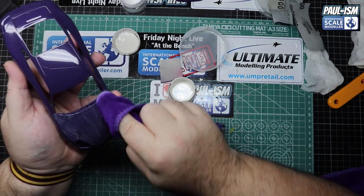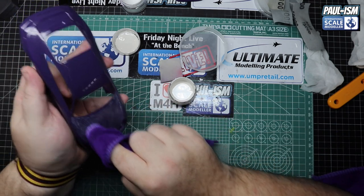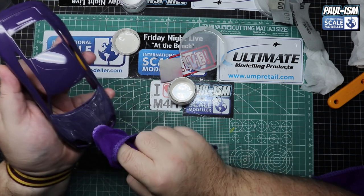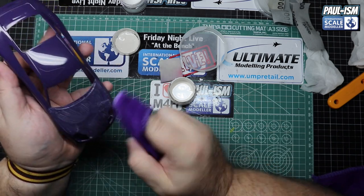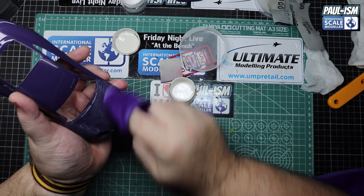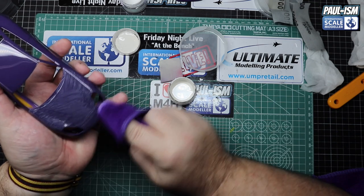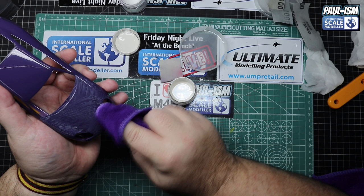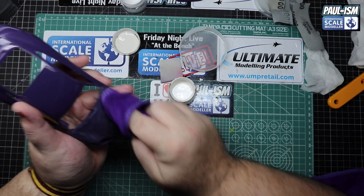And all we're trying to do is get this to a nice high shine. And again, once you wipe this off, you need to repeat the polish or go back a step to the compound, or if you think it needs it, go back a step to the micro mesh. So it's a fine line, step by step, seeing how you go until you're happy with the finish that you get. But the beauty of 2K, like I say, is it dries fast, it dries rock hard, and the finish out of the airbrush, in my opinion, is unbeatable than any other clear coat out there.